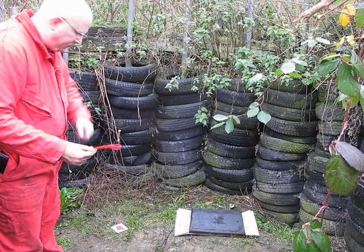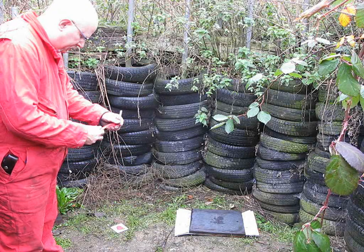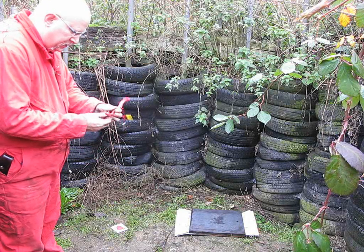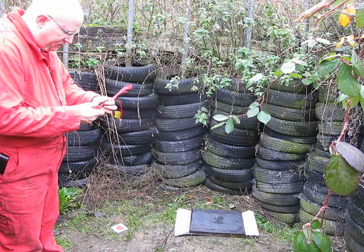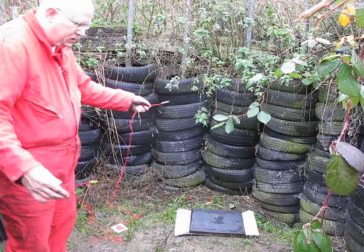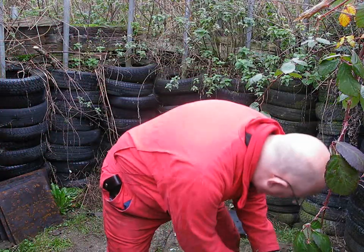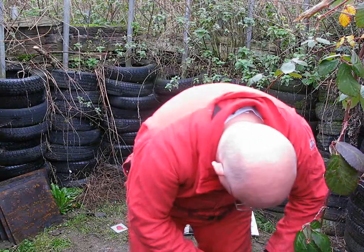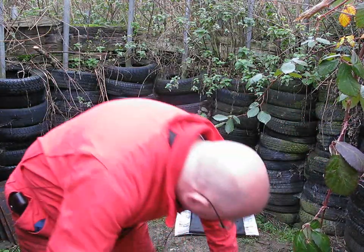I need to connect my detonator to my firing leads and then insert it into the explosive. But I connect it to the firing leads first, but put the detonator in a safe place so that if there's some stray current to set off the detonator, it goes off but doesn't hurt me. I'm going to drop it down that little rabbit hole in the corner there, and then I'm going to connect it to the end of my firing cable here.